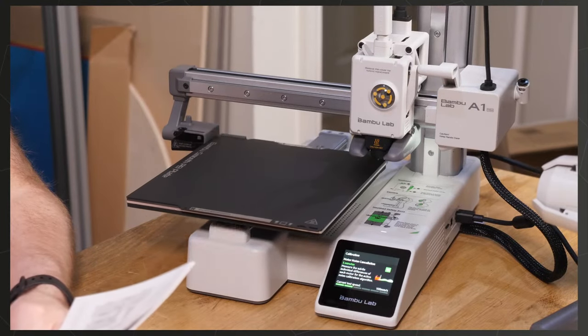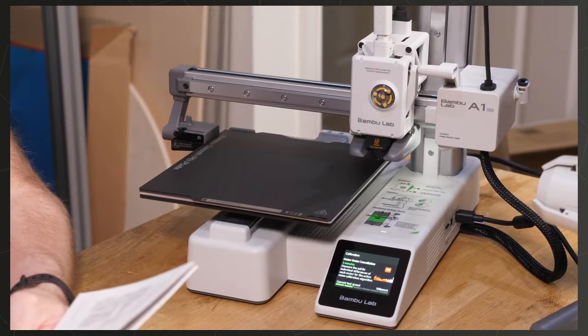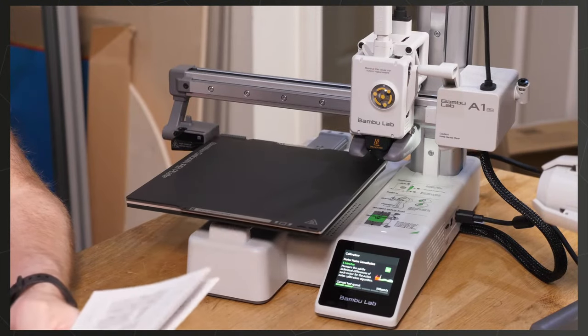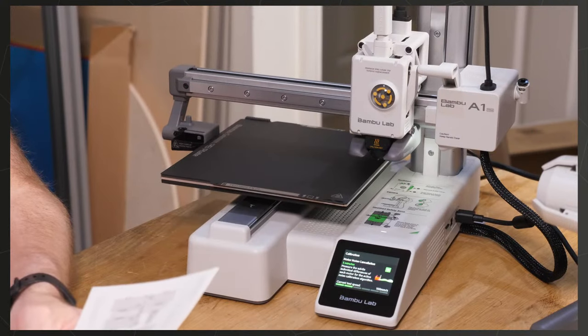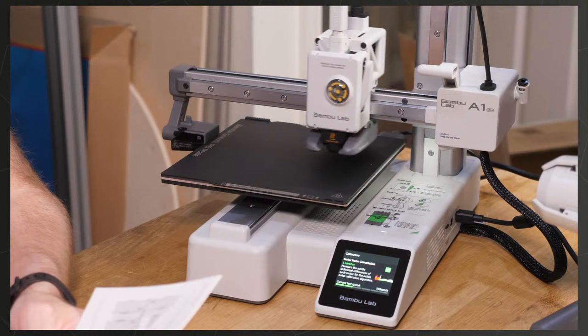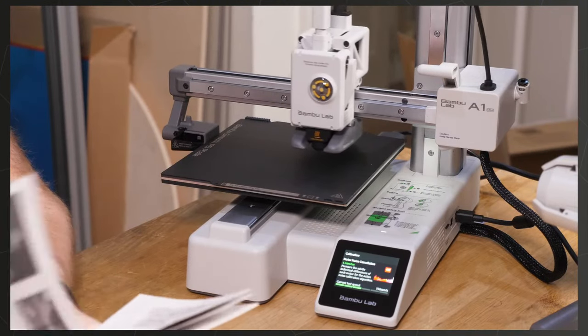Note, press the release button to disengage the driver motor if filament is stuck. Push the spool all the way onto the retractor, feed the filament into the filament inlet, connect the tool head filament inlet and the filament guide with the PTFE tube. Hang filament spool on spool holder, then feed the filament line into the BGF. Oh, that's for single spool. And then first print.